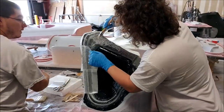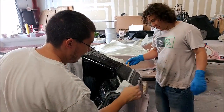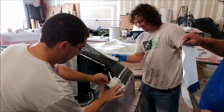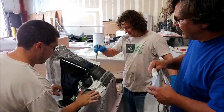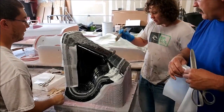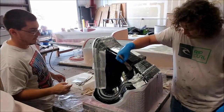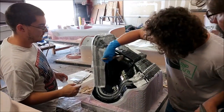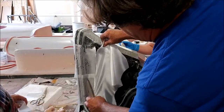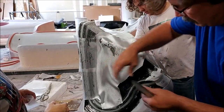Welcome back. In the second half of this week the guys are busy working on a bunch of different molds. This one is for the center stack that goes between the center console and the lower half of the dash. They're putting down the first layer of light fiberglass — wetting down an area with resin and carefully laying out the light glass, working out any bubbles.